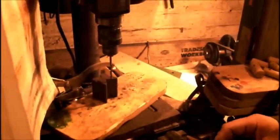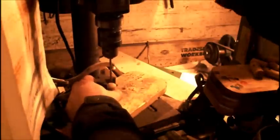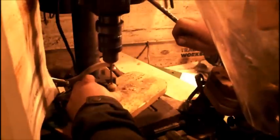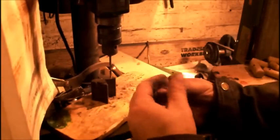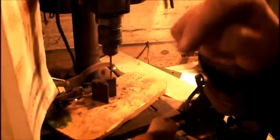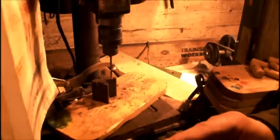Now, this is one of those do as I say, don't do as I do things. If I bullseye that where I think it's going to be in the middle, that's pretty much in the middle. It's a pilot hole for the correct drill later on. Plus, as I mentioned earlier, this hole goes slightly deeper, so I don't get that air pocket, which gets that bicycle pump effect.